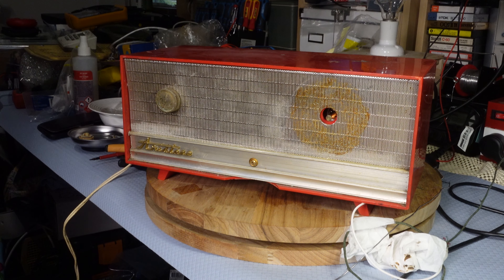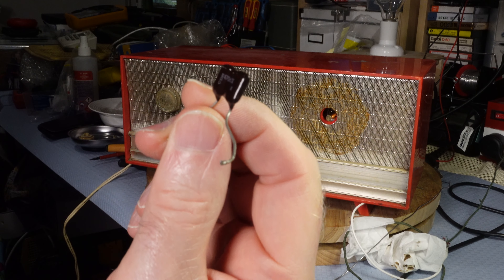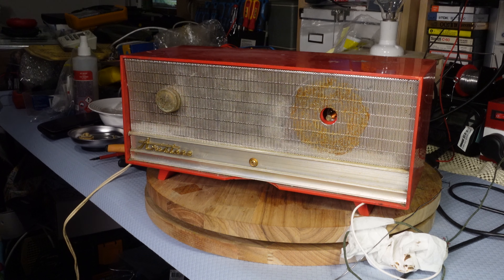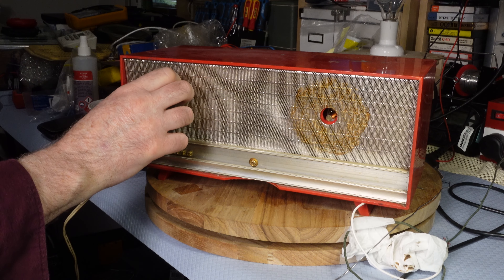As a postscript to this Aristone: I replaced this 470 picofarad capacitor with a 470 ceramic capacitor — it actually measured at around 427 picofarads. And guess what? This is absolutely dead stable.